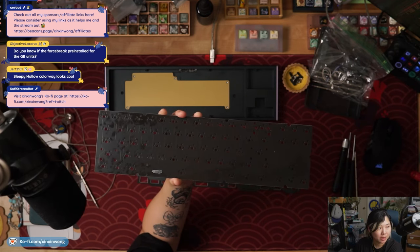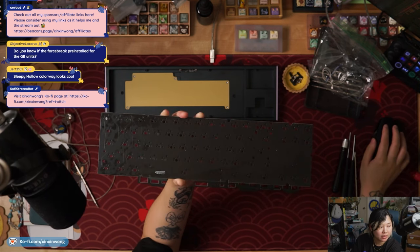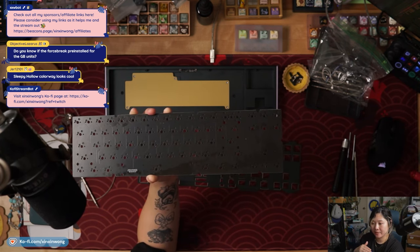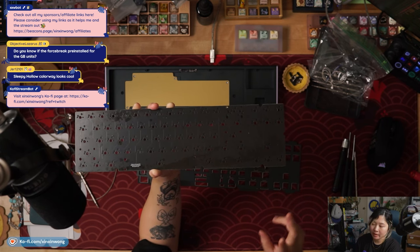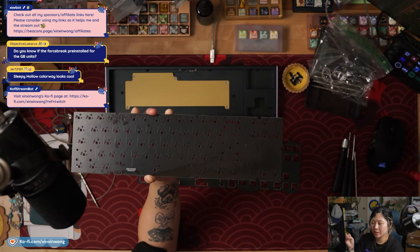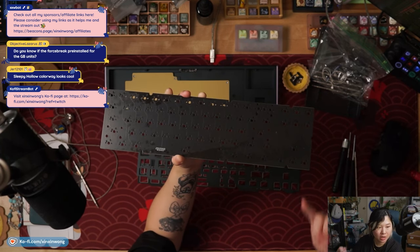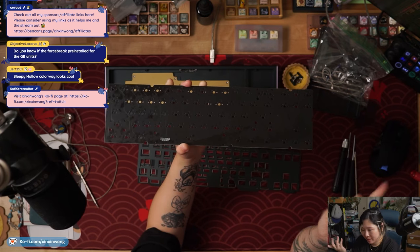Looks like the hot swap will have QMK via 1.6mm. Solder will have ISO. And on top of that, they'll also have a wireless one. With wireless, you can only have two choices. You can either do split backspace or split the right shift. There is no stepped or regular caps lock. So 3 PCB options: solder, hot swap, wireless, and then you can buy the daughterboard kit.